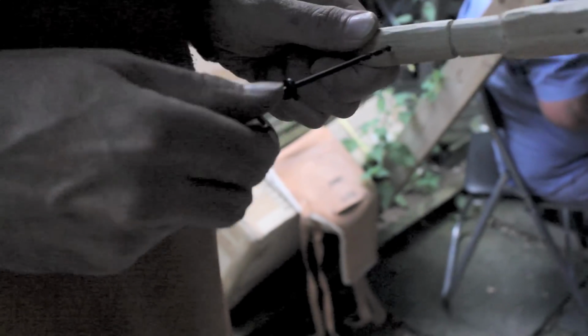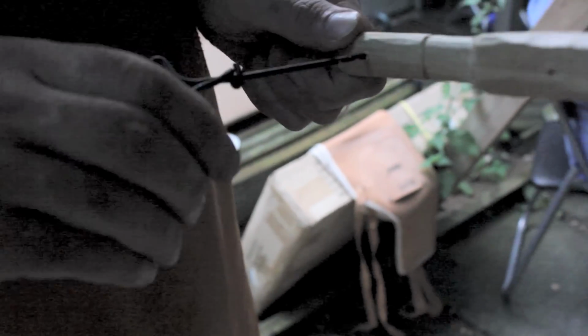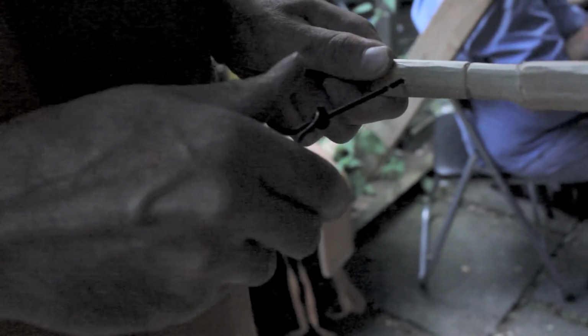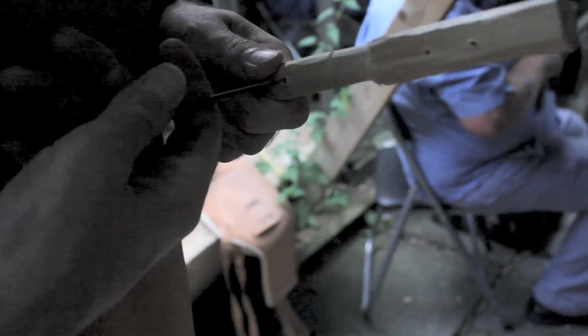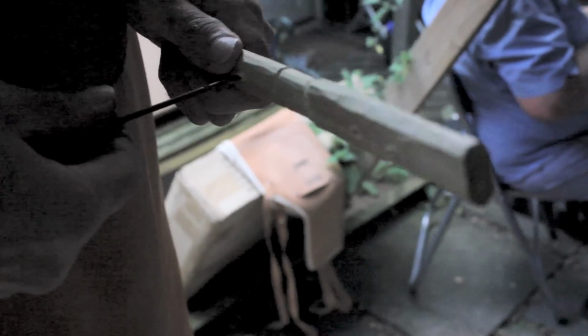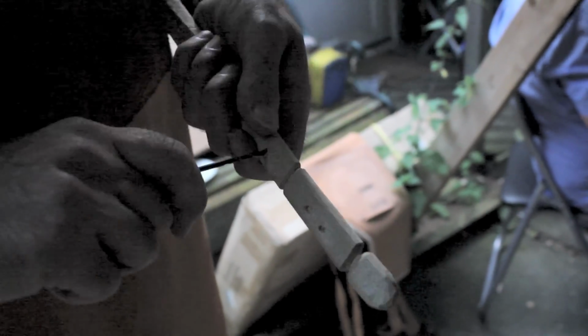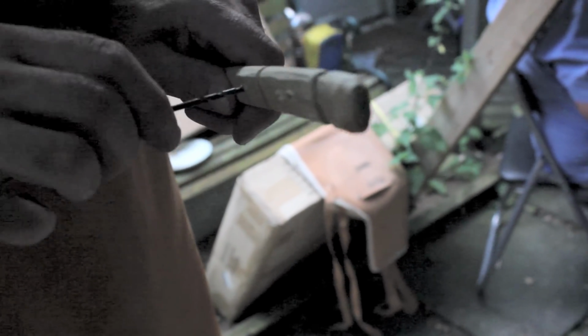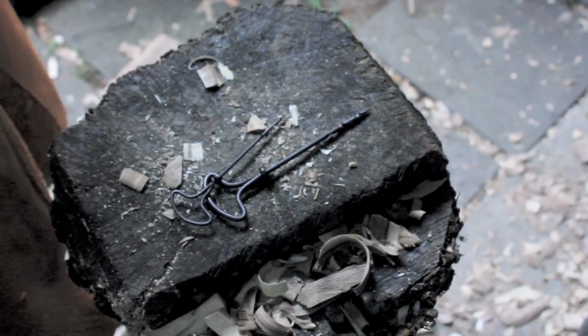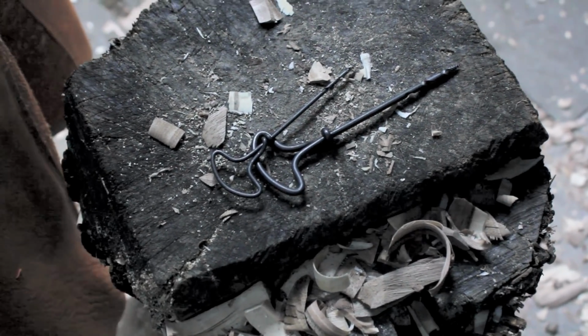This one's probably about 3.5 millimetres. I don't know exactly the sizes of these. That's gone through that way, so I'm going to unwind it this way and then come back the other way. It's a little bit long-winded, but it should give you a hole that's fairly clean without splitting your wood. The reason why I'm practicing this now, especially under the tutorship of someone like Lee, is I want to be able to do these out in the field without any issues.